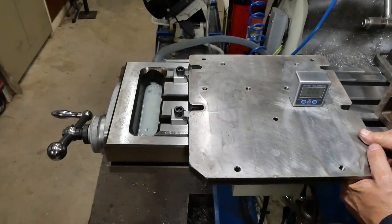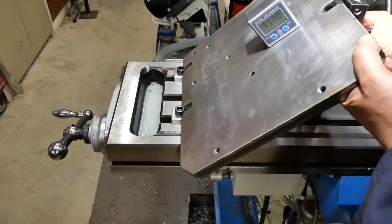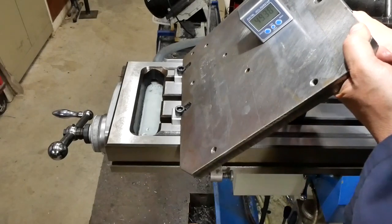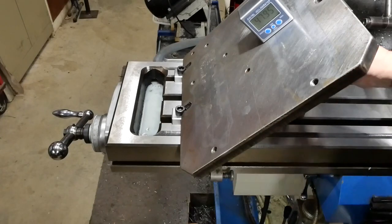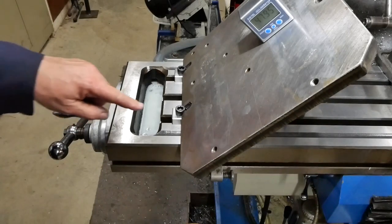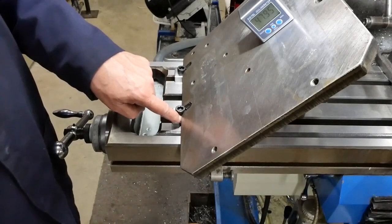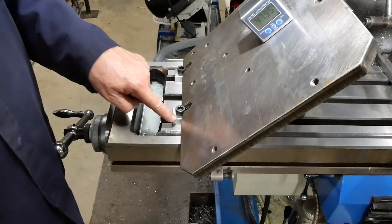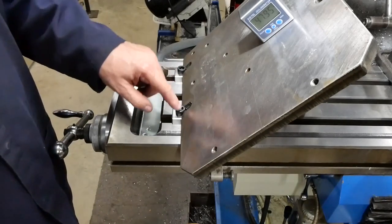But more importantly, stand it up. I think you can see that it's showing 48 degrees, so 45 is obviously easily in reach now. I could have machined a bit more off and made it go to 90, but as I said before, I really can't see why I'd ever want to do that. I've got angle plates and other options, and it just starts getting a bit awkward.